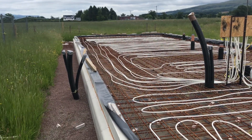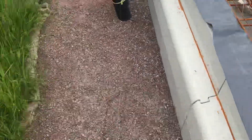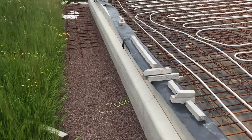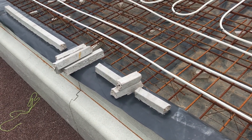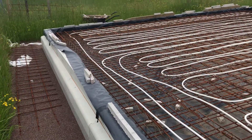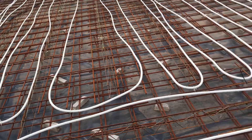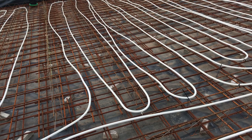Here's the insulated heating pipe. It's pretty flat — I put a laser around the outside and it's about 6 to 8mm high. I just don't know whether it's worth cutting that down with a hot knife or just leaving it as is. They're going to use a laser to get the concrete level and they'll probably want to screed to the outside, so you could get it nice and level and know the screed will be where it should be.